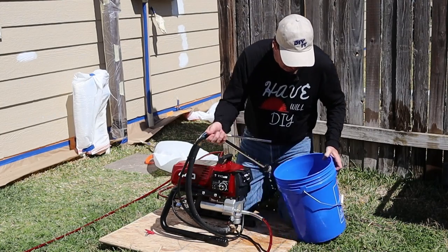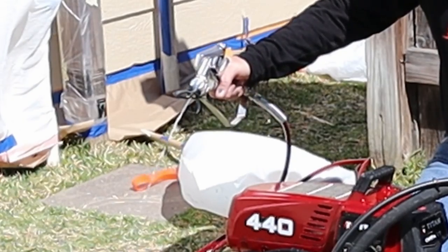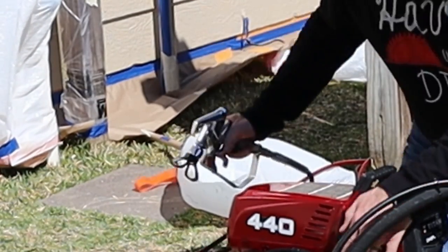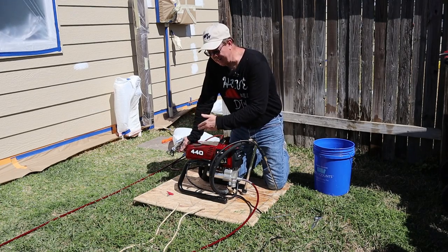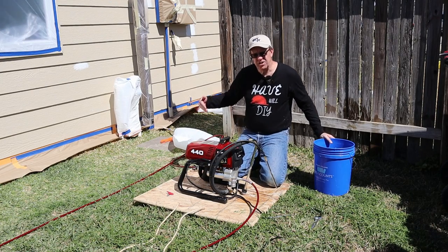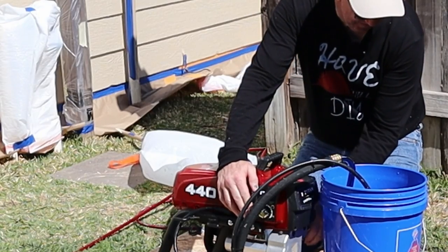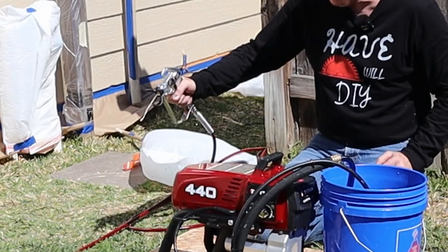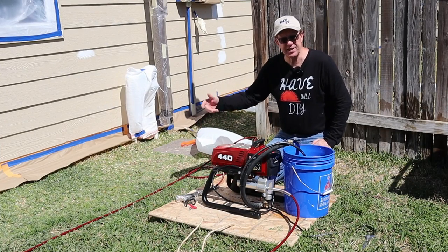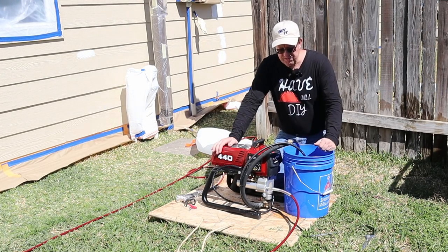The other thing you can do is pump the paint back into your can and let it pump until you're getting nothing out. Now there's a bunch of air in there, so when you put your water in and prime and spray, you'll know you got all your paint out because soon you'll start spitting air and then water will come through. You saw how we got some water, spit air, and then water — that's your gap. There are a couple of different ways to retrieve as much paint as possible. Now we've got it all primed and ready to paint.